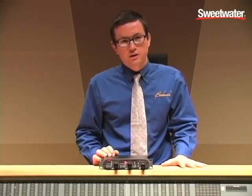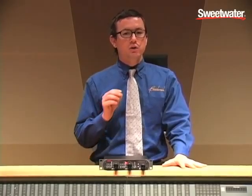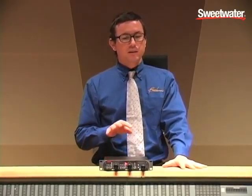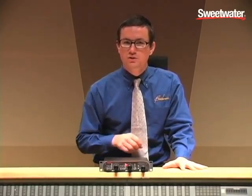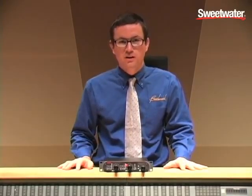It's very unique to this product. There's also a phantom protection circuit in here so that if you accidentally plug in or unplug a microphone while phantom power is on, you won't hurt the preamplifier. That can't be said about a lot of preamplifiers, but it's very important because you won't find yourself in the middle of a session with a fried preamplifier.